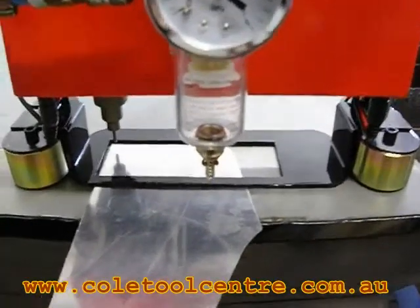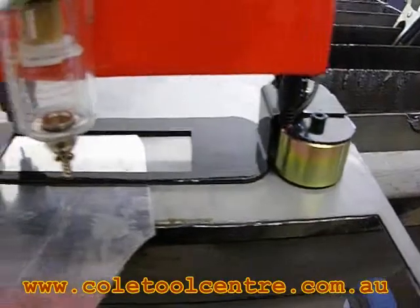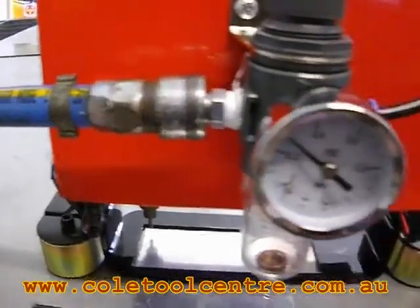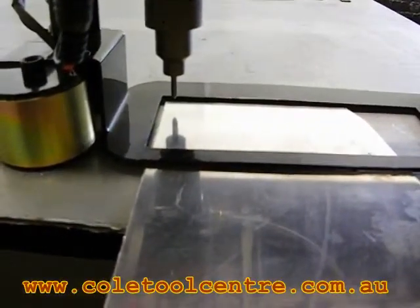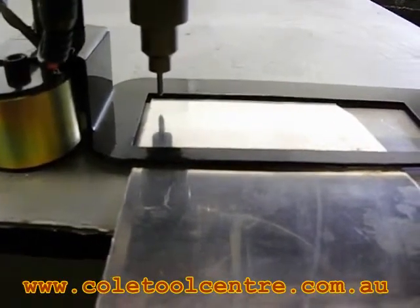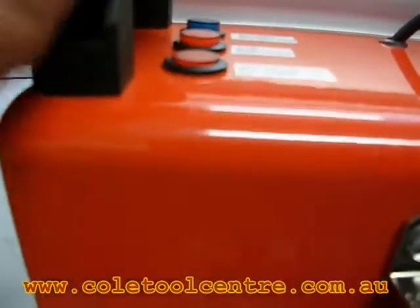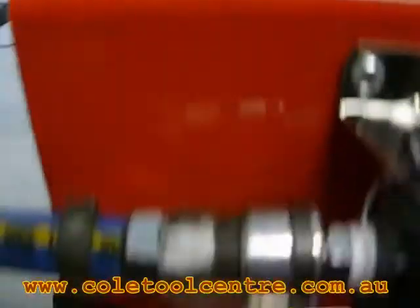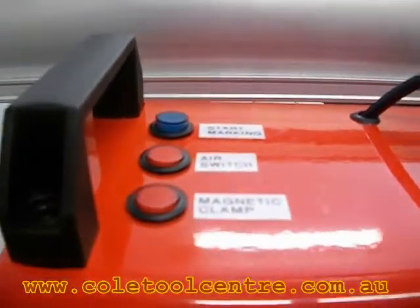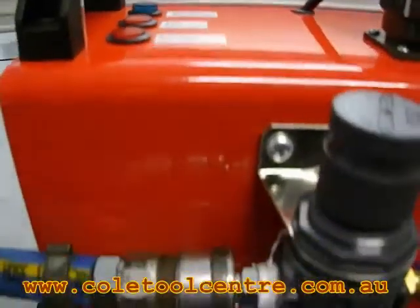We've come from the software. I've got a piece of aluminium in there, which is not magnetic of course, but I have a magnetic piece of steel underneath it which will hold it. The airline is now attached. To line it up, the pin is going to start right in the top left-hand corner of the sign. First thing we do — turn on the magnetic switch. You can give it a wriggle and that will actually make it seat properly. Turn on the air switch. If you don't turn that on, it won't actually engrave — it'll just move over the surface. It's very noisy, so you'll probably need earplugs.